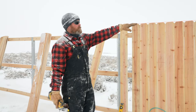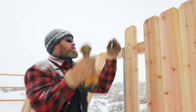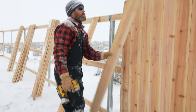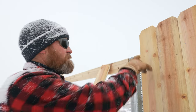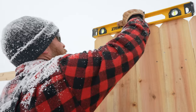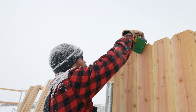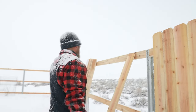We've reached the end of this grade and are starting a new grade. When you reach this point, take your string line down — that's why you use screws — because this last picket will come off. It's very rare there's a chance it's going to match up just right. When you put your screws in, try to stick with your nail pattern and I'll do my best to get the nail right back in the same hole so you don't have a random hole. You can take your level or your bump board and that'll tell you where your picket's going to go, and then you just take your string line from that picket.